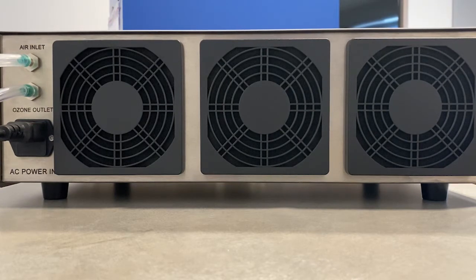You can notice the three fans also on the back of the 5000BF. It is important to note that these fans are to keep the corona cell cool while ozone is being produced. Keeping the internal temperatures low is an important key in producing efficient ozone and maximizing the life of your generator. Make sure that nothing is blocking air from the back fans so they can properly maintain an optimal internal temperature.